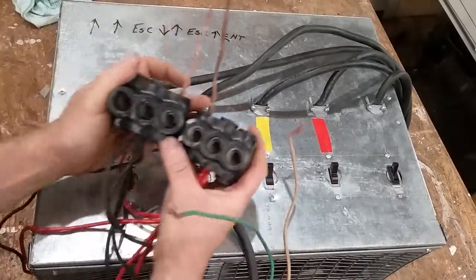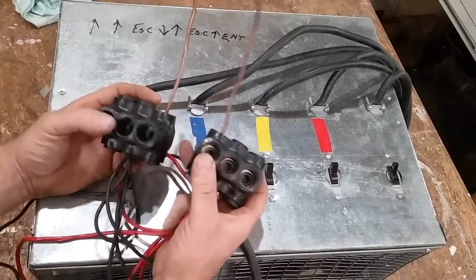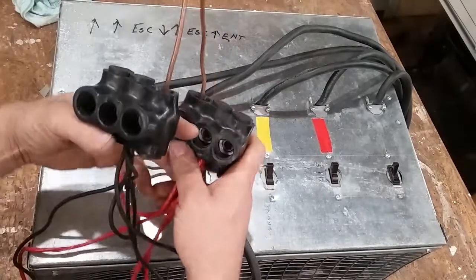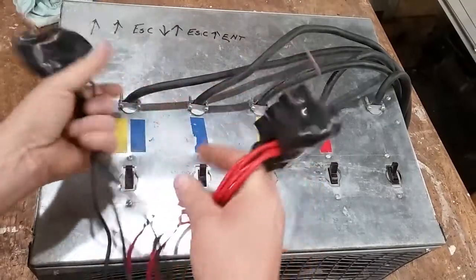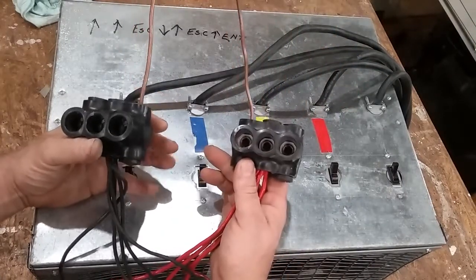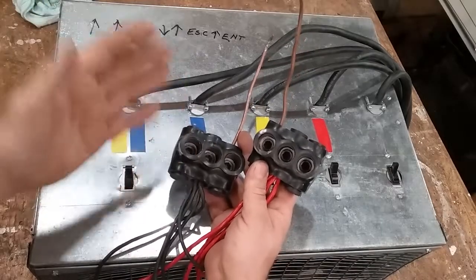This conglomeration here is about as dangerous as it looks. I just wire this in to the transfer switch while I'm doing a load bank. It's kind of handy because I can stick my probes right in here, wrap an amp clamp around here, and get amp measurements, voltage measurements, and frequency measurements. As I'm loading and unloading, I've also got my manometer — usually I've got a ten-foot hose for my manometer.